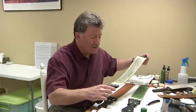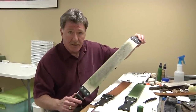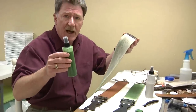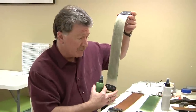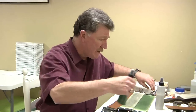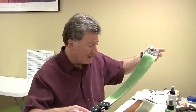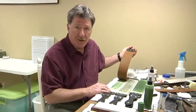Other methods for a simple refresh: felt is a great media. I already have this particular strop treated with chromium oxide — you can tell it's had quite a bit of use by the darkening on there. With the diamond spray, I'll take the sprayer and come up and down at about 6 to 8 inches away, let it dry overnight, and then it's ready for use. For you at home, finding one of these that works best for you is the way to go. The easiest and most inexpensive way is just to treat the inside or back side of your canvas or polywebbing strop.